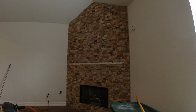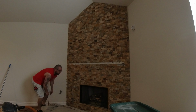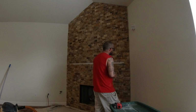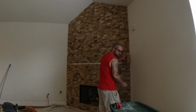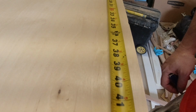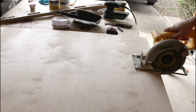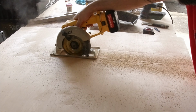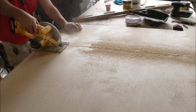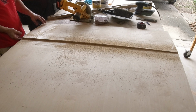What we wanted to do with this project was build a wall. Obviously, we're leaving the stones. We're building a wall over the face of this stone, and the customer wanted to avoid an expensive and messy demo, which is certainly what this would have been. So we started by cutting a piece of plywood to width, taking into account the thickness of the new wall that we were adding on. It's 1.5 inches for the 2x4 on the flat, plus 1/2 inch plywood. And I cut it purposely short of the wall left and right. More layers are going on top, so no real need to make this super tight. Give yourself some breathing room here.